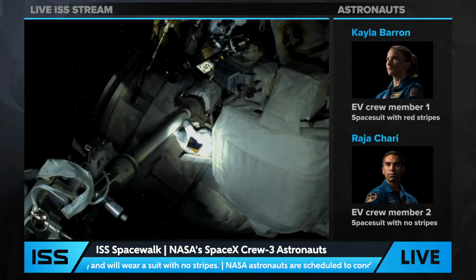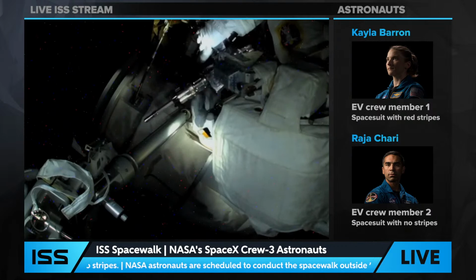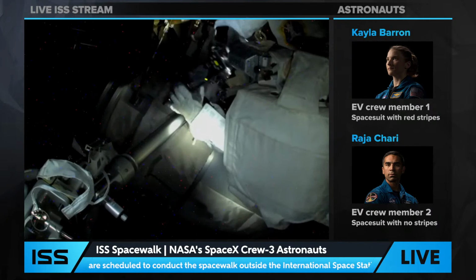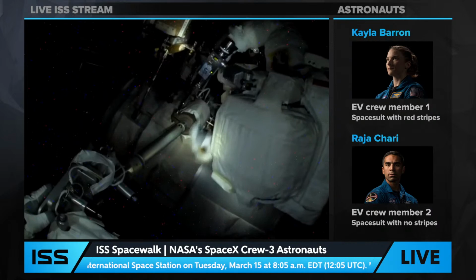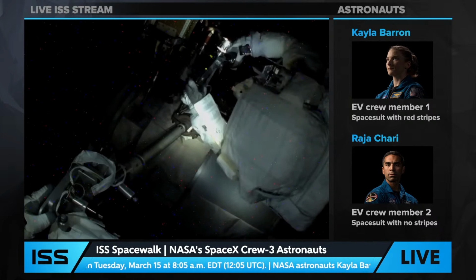And so, Kayla, we're going to have you ratchet with the PGT. And we're going to set it to ratchet clockwise. Check the MTL to 30.5. I'm in ratchet clockwise, and MTL is in 30.5. Okay, we're going to manually ratchet M25 and 26. To torque, we're looking for 2 pops on each one.